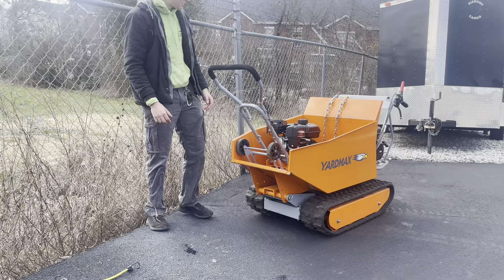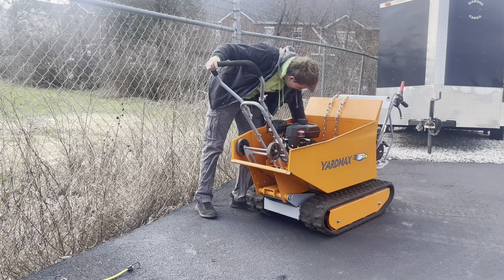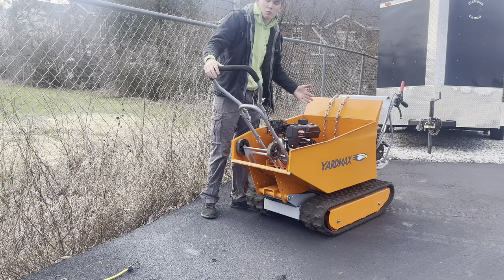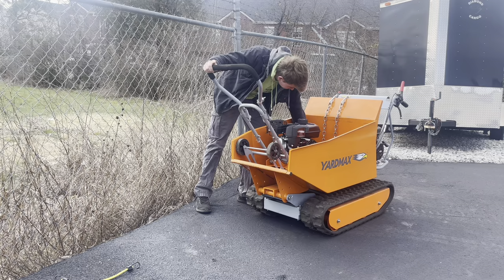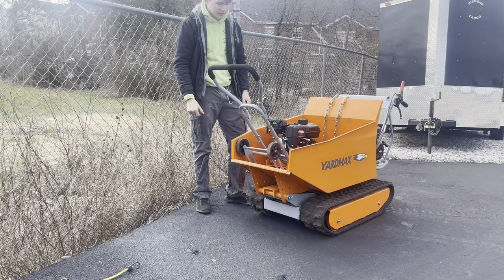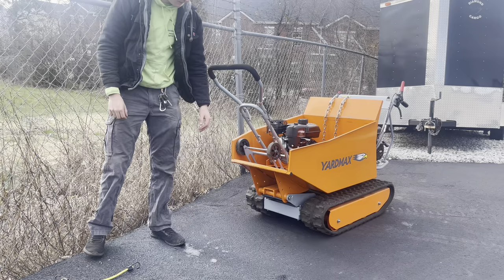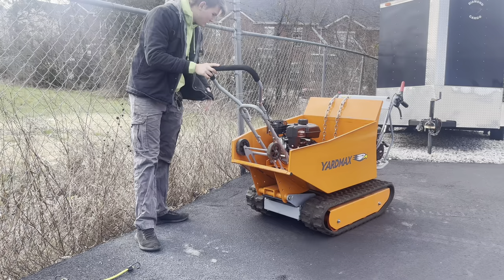If I were lifting something heavier, I've thought about having someone weld D-rings or some sort of attachment point lower down inside the bucket, because that's where it's more stable. When the connection point is up top and you're lifting something heavier, it has more leverage to bend things. So if you want a chain attachment point inside the bucket, weld it toward the bottom with enough gap to hook your chain in. You could also put attachment points on these side frame points, which are thicker and more supportive and won't interfere with dumping.